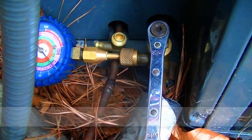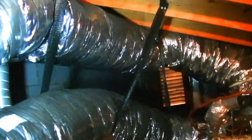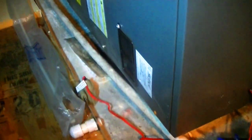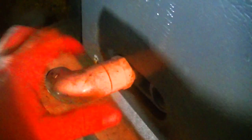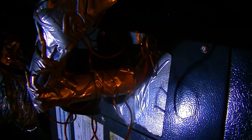We're going to head upstairs and cut the evaporator free along with the drain. Here's our Goodman AEPF air handler - variable speed, back from 2009. Not a whole lot of room up here. You've got the return ducts run behind here and a TXV - TXV is required to get the 15 SEER on this unit. I've got to cut the drain free down here and get that copper and TXV taken apart so we can slide the old coil out and put the new coil in. We have our drain disconnected here and we'll probably replace the trap because it's full of some nasty items - pretty easy to do, saves us a little service call for later.